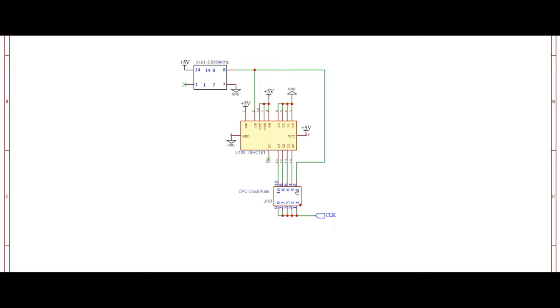And again, I need to emphasize here that at each point of time, you will only be connecting one set of those pins. So you cannot short, let's say, 2-1 and 4-3 at the same time. You will either be using 2 and 1, or you'll be using 4 and 3. So that's really all about the clock cycle. Hopefully it's clear how it works. So let's build it on PCB and test it using a scope.